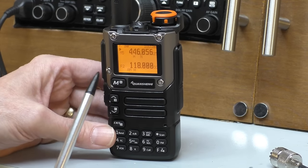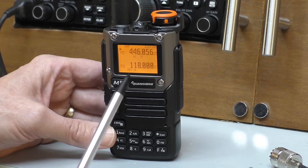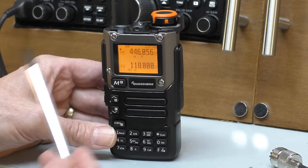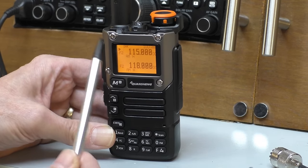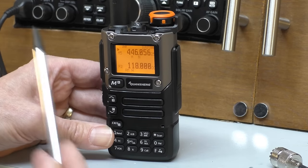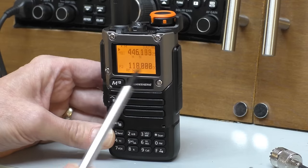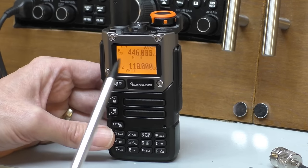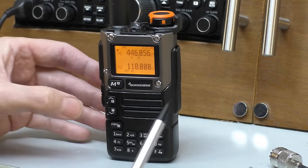For scanning shortcuts to work you need your squelch set high enough for static to be muted. To change between frequency mode and memory mode: at the moment you can see I'm on memory 5, one of my PMR memories loaded via CHIRP. To change to frequency mode just hold down button 3. To change back hold down button 3 again. To do a basic scan on those 16 preset channels simply hold down the star key marked 'scan' for a couple of seconds. The radio will scan around the 16 channels until it finds a transmission and stop. To exit scan, just press the PTT.